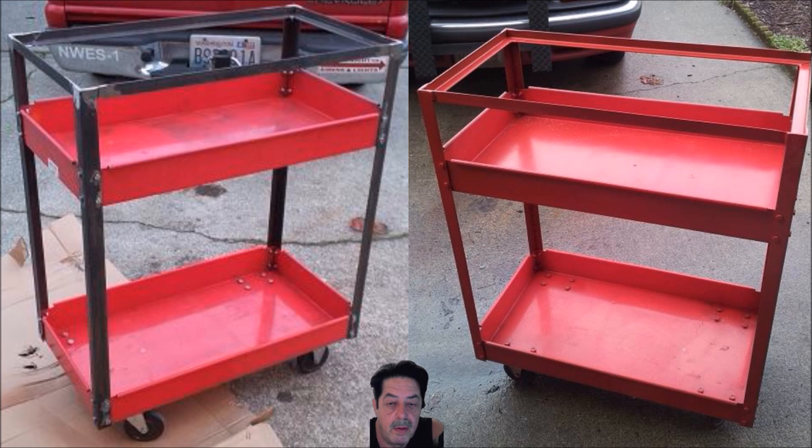Let's look at the one on the upper left. He went out to the steel supply place in town and bought some inexpensive angle iron — a 10 or 20-foot section that he'll use for other projects too. He came home, cut the vertical pieces, marked the holes, and drilled them. You might need to stop at Home Depot or Lowe's and pick up a different size bolt — he told me he did, because it was a lot easier than forcing other things to fit. He used a hand drill, marked the holes, drilled them out, and re-bolted the uprights.